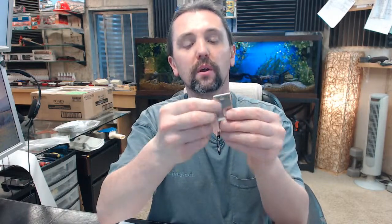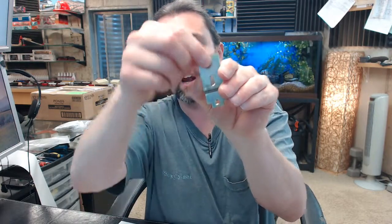So your installation is going to be that you're going to cut the rectangular hole as required by your lock. Your mounting tab will be drilled and installed into the door by drilling a hole, doing a slight countersink, and then attaching it right to the tapped hole that's here at the top. And then you're going to have this part of the tab hanging down into your slotted opening, whatever that height is required.